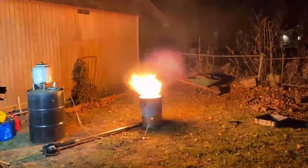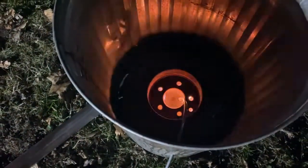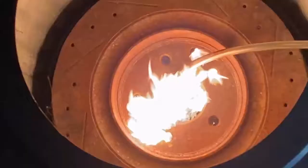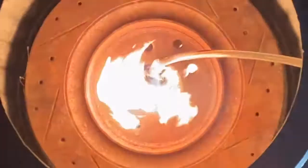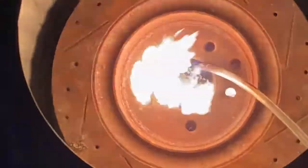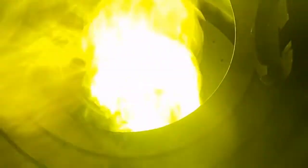Hey, spilling the beans for Don today — we got to show exactly how we got this thing working. What we're looking at here is our flame catch. This little setup catches that fireball especially during ignition and keeps it from blowing right out the front end. Without this flame catch or flame holder, we would not be able to sustain the ignition combustion. We're using a brake rotor to act as a heat retention battery — to store heat from the fireball to help vaporize the fuel better — and it's also acting as a flame holder for the nucleus of the combustion.